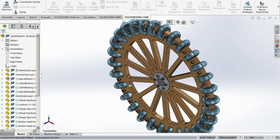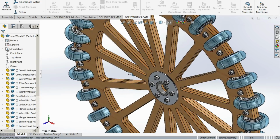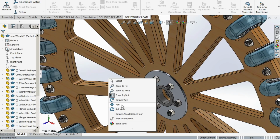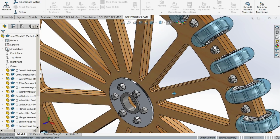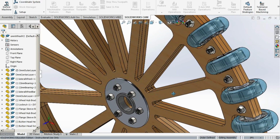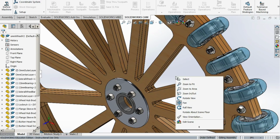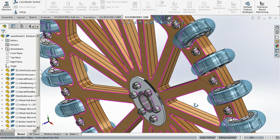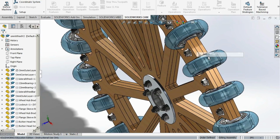Here, for example, is what our large Omni wheel is going to look like. You can see it's made out of 3 layers of plywood and held together with 1/4-20 nuts and bolts. All around the larger wheel, you can see these smaller skate wheels facing perpendicular to the direction of the larger wheel, which is going to allow it to translate left and right. Each of these is on an 8mm axle, which is embedded into the central layer of the plywood.